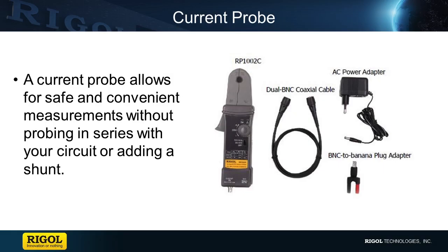Current probes. Measuring current can be accomplished by inserting a probe in series or by using a shunt. Both approaches require unsoldering wires or breaking connections. As currents increase, there are safety risks and shunts can get hot. Voltage drops across added connections can also affect accuracy.